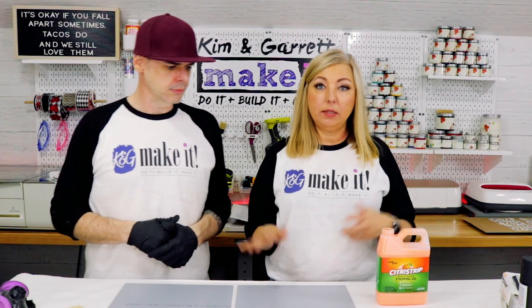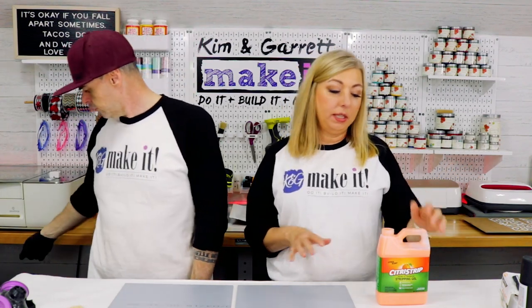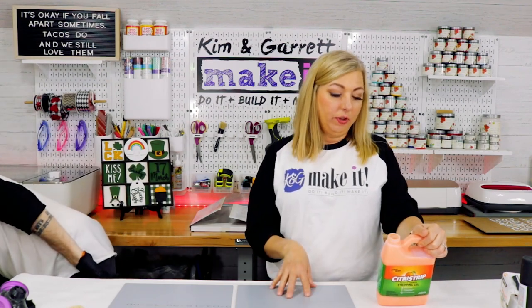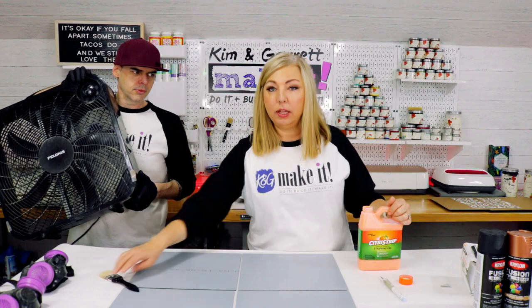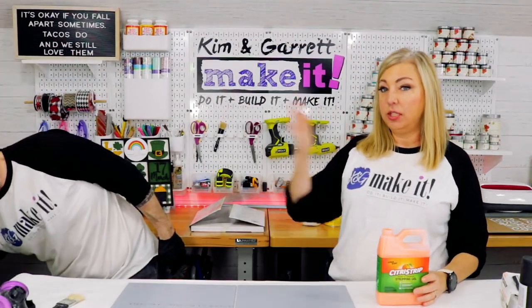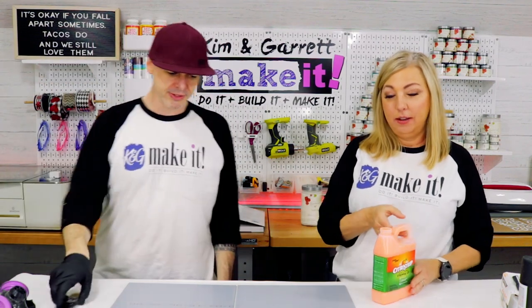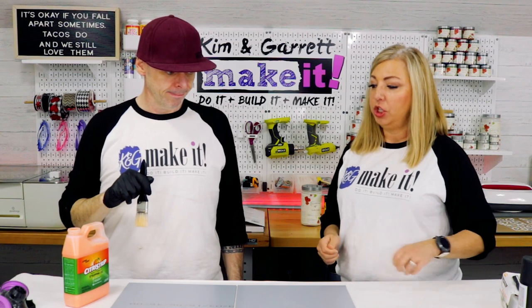After we apply this, we're gonna leave the room and let it sit for 45 minutes. It says you can leave it on for 30 minutes to 24 hours. We're gonna try 45 minutes. I'll let you know if that changes. I got a fan. All right, well ventilated, cross ventilation. Cross breeze. We are on it. Paint and varnish stripping gel.